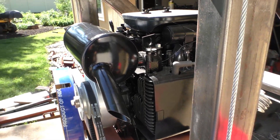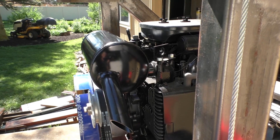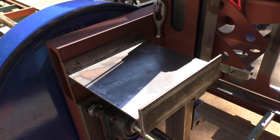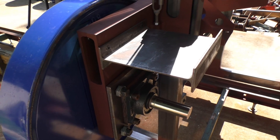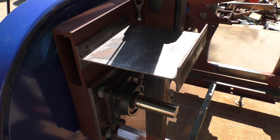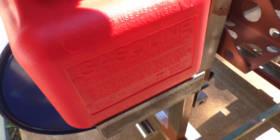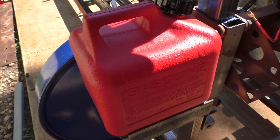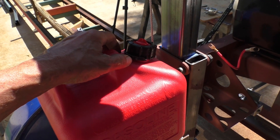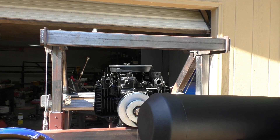That's what the muffler is going to look like installed. I had to move and alter the inlets and rotate it in the opposite direction so it was pointing down. I had a piece of I-beam left over from our garage build — you can check that video — and I cut off a piece to make a place to mount the fuel tank. This engine has a fuel pump, so I can drill a hole through the top of the filler and drop a tube down inside.